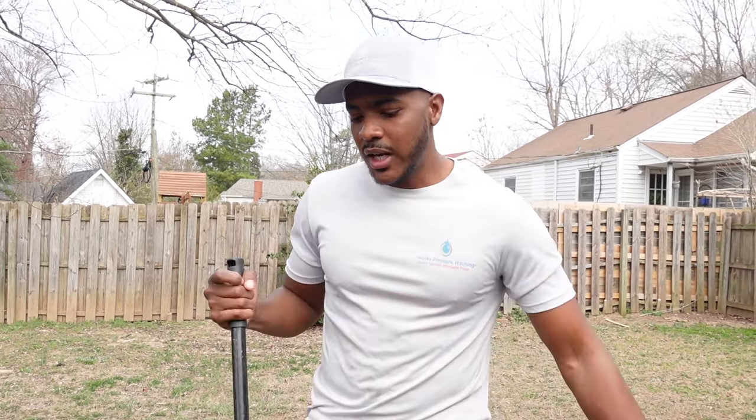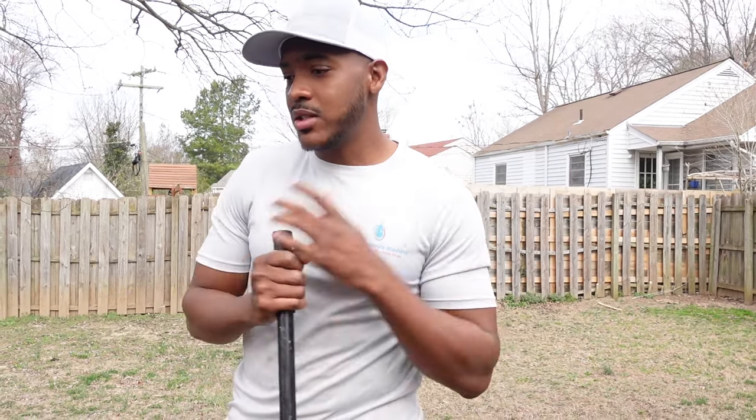Don't get too close, and if you can, go with the grain. Using a surface cleaner on the deck, I've done it before and had good results, but for the sake of this video, don't use a surface cleaner, because I feel like for most people who don't have any experience, you could tear up a deck. So we're going to stay away from surface cleaners for now. I'm gonna just finish cleaning this deck off and we'll get started with the process.